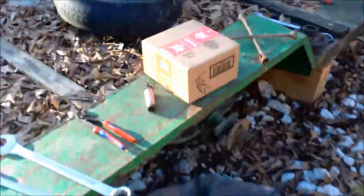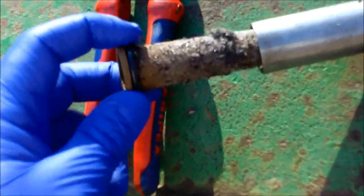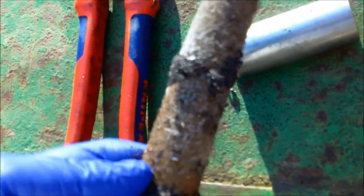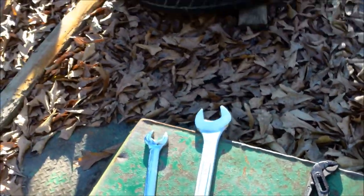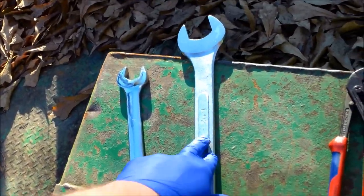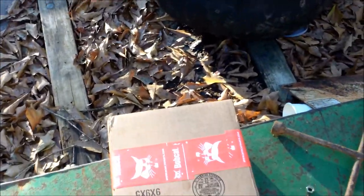Let me show you my old one. As you can see, there is junk — there's crap all in this filter. This is the sleeve that goes around it and then you have a spring that goes against the bung. Tools you'll need are a one inch wrench, a one and a half inch wrench, and channel locks — that's basically what I grabbed it with. You'll need a new filter. Bobcat sent me one; they're only about 18 bucks.